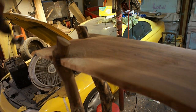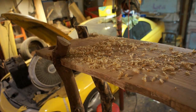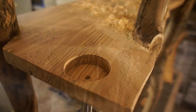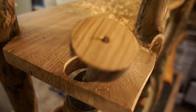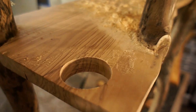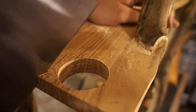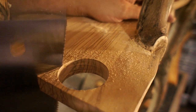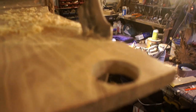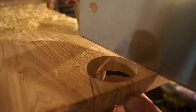The top shelf was finally freestanding and strong. Going back and reinforcing it by adding some more uprights. I drilled almost all the way through the top and then came up from the bottom — that's how you prevent blowout, where the grain will just separate because you're pushing through at the very end of the hole. That would be pretty unsightly, so I did everything I could to avoid it, especially this close to the end of the project when the stakes feel so high.